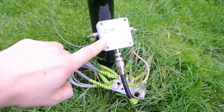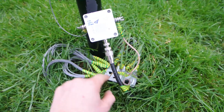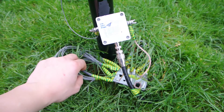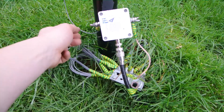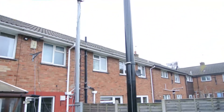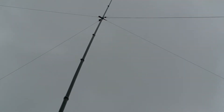Here's what we've got — here's the balun from Cross Country Wireless. The earth wire comes out and goes into my earthing plate. I've still got the radials attached — according to the drawing you don't need radials, but they're already here for the vertical and I figured they can only improve the ground, so I left them connected. Here is where the antenna wire comes out and goes up the mast, about seven or eight meters up, with four guy ropes.